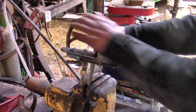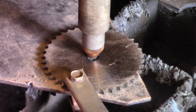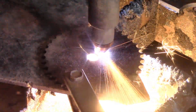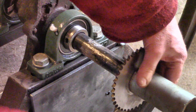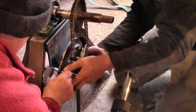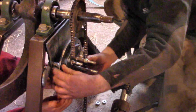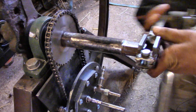One socket goes onto the shaft that runs through the valve, and the other goes onto the main flywheel shaft. It needed drilling out a lot but I don't have the tools for that, so I carefully used my plasma cutter instead. The whole thing is mounted on a back plate which is fixed to the frame. I'd made slots so I can rotate the whole valve assembly until it opens at just the right time for the piston stroke — in other words, to set the timing. This was the part of the design I was most pleased with; timing this valve should be easy peasy.